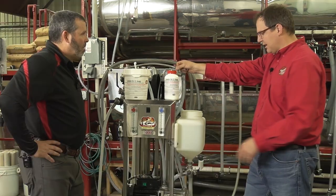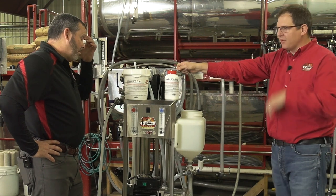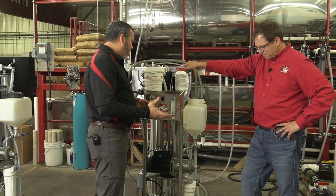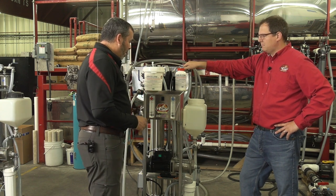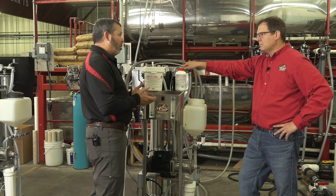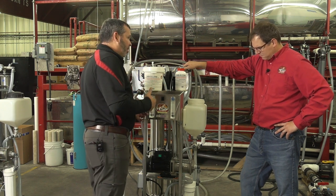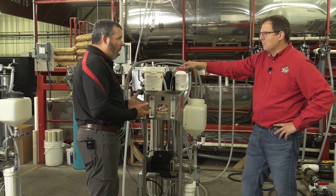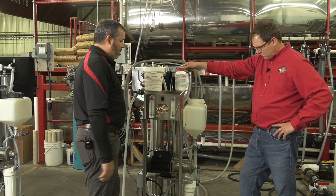You'll start to see the water discoloration in the tank. Regarding pre-filters, they can get plugged up — the more you use them, the more stuff collects inside. Soap can slime them over and disallow flow, especially if they're already plugged with minerals and bacteria. You may have to change the pre-filter out after a wash. Just periodically check your pre-filters.